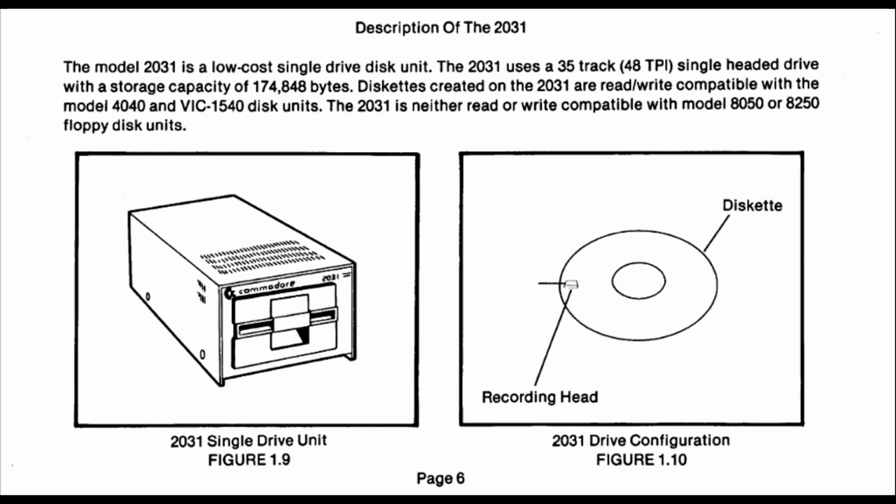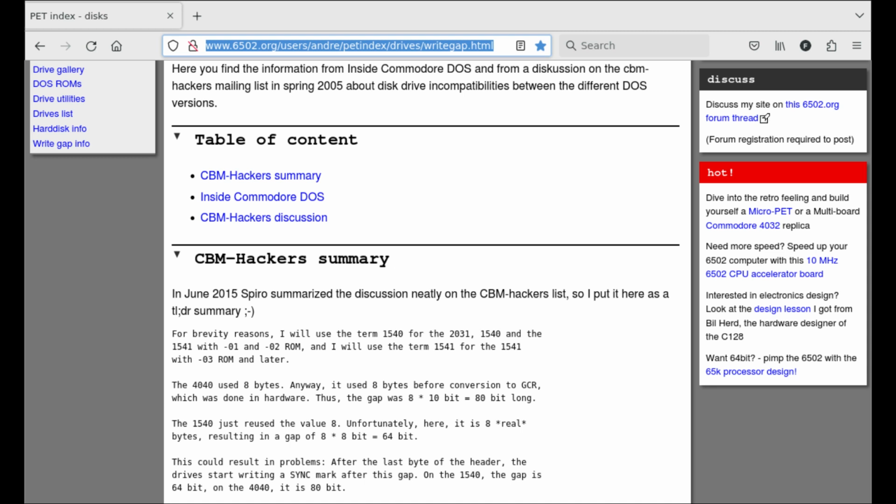Now that I'm confident that the disk drive I've got has no evident faults, let's quickly see what are my design goals. Of course, I want the drive to be able to run the original 2031 firmware, even if I don't plan to use the unmodified firmware as the final one. For instance, the original 1540 and 2031 firmwares produce some differences in the disk format with respect to the 4040 dual disk drive. These differences are described in this web page, linked in the description down below. These differences have been mitigated in the newer releases of the 1541 drives, but it seems no new revisions of the 2031 firmware can be found.